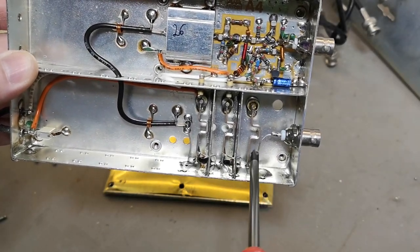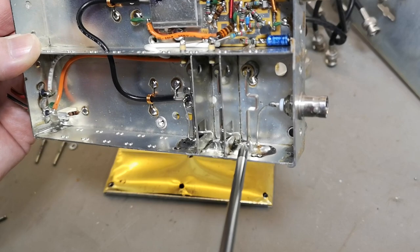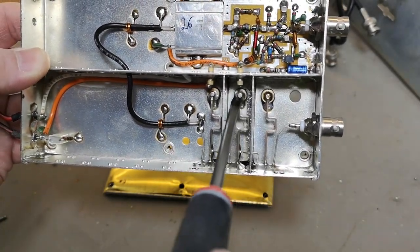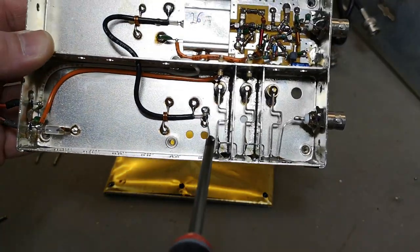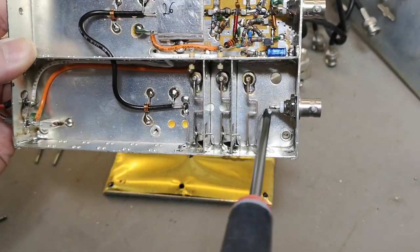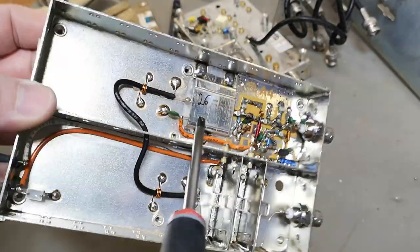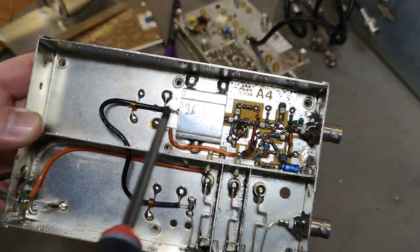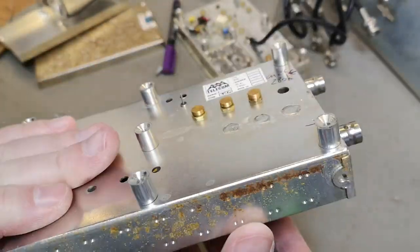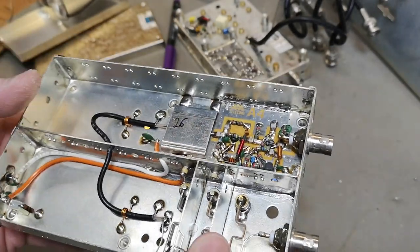Inside the first entry box we can see an inductive coupling to the first resonator, with a tiny pickup that avoids loading the resonator. Then a direct connection to the next resonator, the same type of pickup, and so on. It goes out via a cable to some sort of thick-film circuit. I'm going to crack this open because I can't use it as-is anyway, but some of the other boxes are nice and clean and I'd like to reuse them for my own projects.